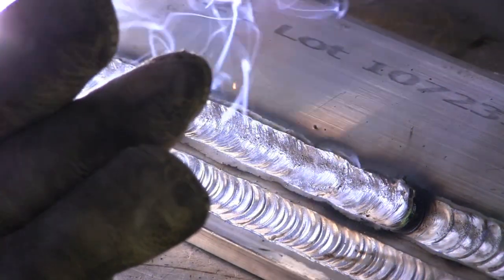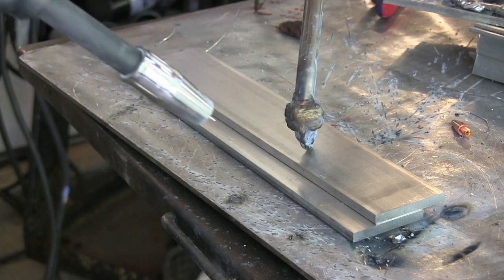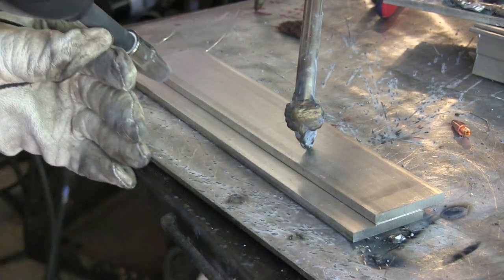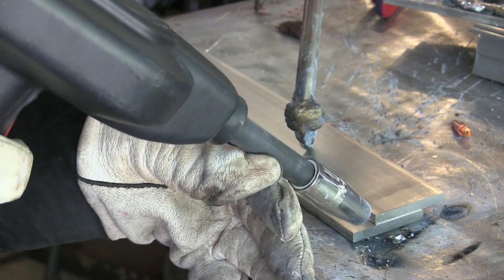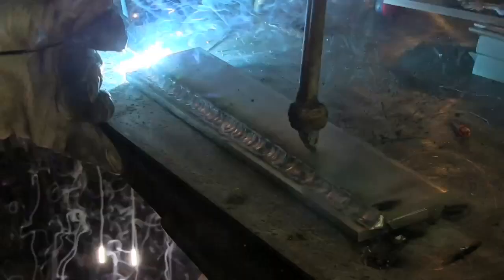After increasing my argon flow up to around 30 CFH, it seems like I'm getting pretty close. I set up a 12-inch long lap joint here — quarter inch thick, roughly six millimeter. The gun angle looks like I'm pulling, but that's a camera thing; it's a slight push angle. As is often the case, that very last weld I ran ran really nice. One thing I noticed about using a spool gun is every time you pull the trigger, something different seems to happen. I'm just doing a straight push, not moving the gun a whole lot.